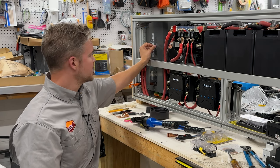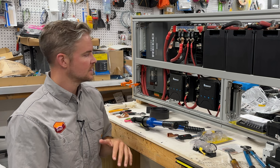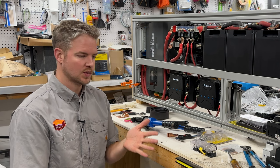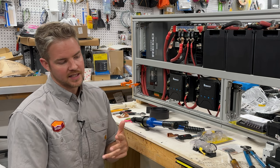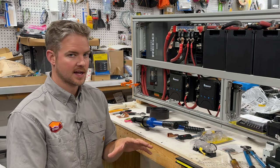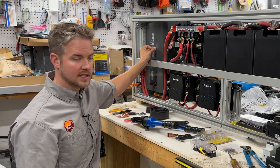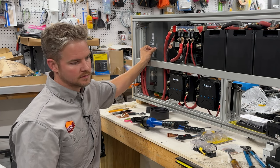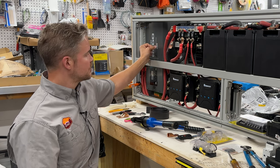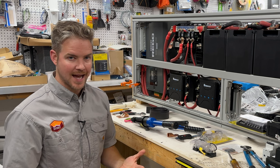And then we have 3000 watt capacity, and that has to do with the livability. You may hear me talk about that a lot in our live streams. If you can imagine, you know, you're at home, not in a van, and you want to heat something up in the microwave, you want to wash your hands with hot water, and then you also want to maybe get on your laptop or do some other activity, but you want to do all this at the same time. So if you have a 1,000 watt microwave, you have a 1,200 watt induction stove, and maybe, you know, you're pulling a couple hundred watts, maybe charging something, maybe a battery brick or something like that, then you really are starting to use up this 3,000 watts. But since you have that headroom, you're able to enjoy all those devices being powered at the same time.